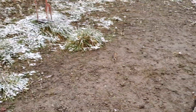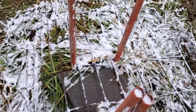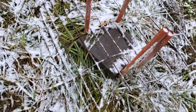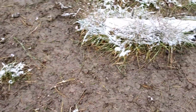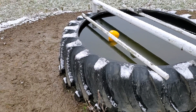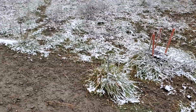On the uphill side of this pad going toward the pond, there's a valve that shuts the water off to the pond. We'll be leaving this farm in a couple days — we simply reach down in that hole and turn the water off. Always turn the water off when you leave a pond, because if you don't, something could break — like that float right there. If that string breaks on that float, it's going to drain your pond. If you don't come back for 60 days, you're going to come back with no water left in your pond. It only takes half a minute to go there and shut the water off. Don't forget that crucial step.